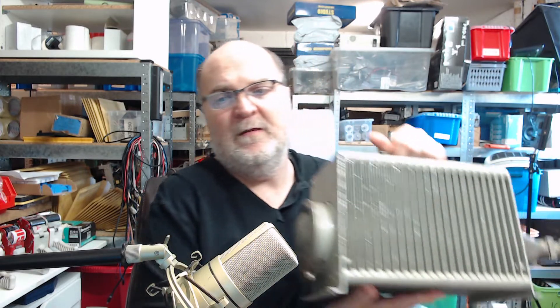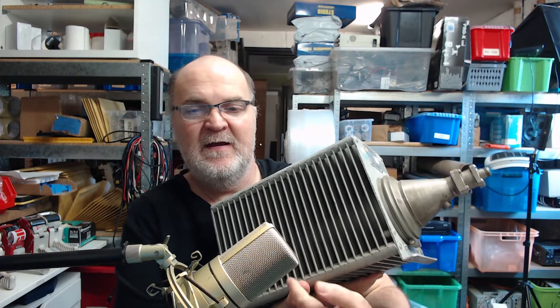These are made by a company called Bird in the United States, and these are possibly the best ones you can buy on a hobby budget. This one is under 100 pounds - granted only 80 to 100 watts - but that's enough to tune an amplifier. The bigger one, this 500 watt dummy load, has the resistor surrounded by oil; the oil heats up and the heat gets dissipated through these fins. It doesn't have a fancy light or switches, it doesn't do anything - it's just connected permanently to the amplifier, selectable by a switch. But you should have one. If you take your amateur radio hobby seriously and spend that kind of money on amplifiers and radios, invest at least 100 to 200 pounds into a decent dummy load and learn how to use it.